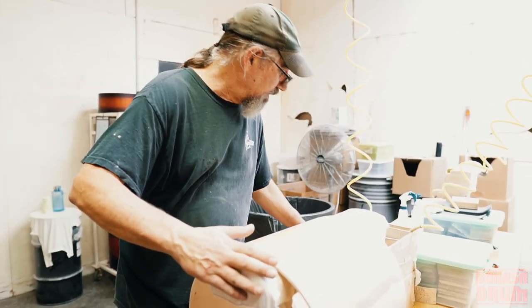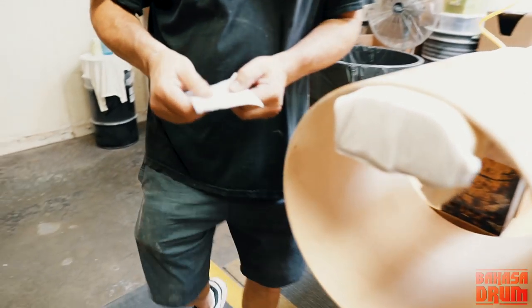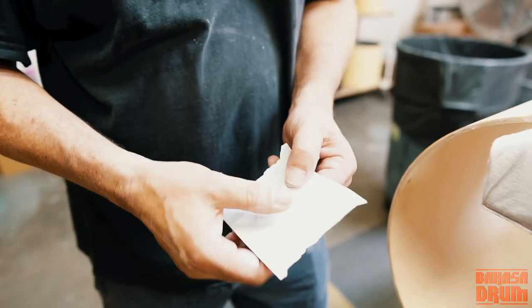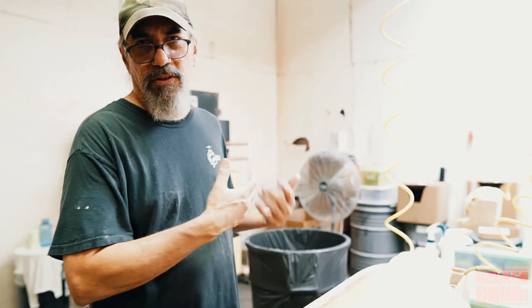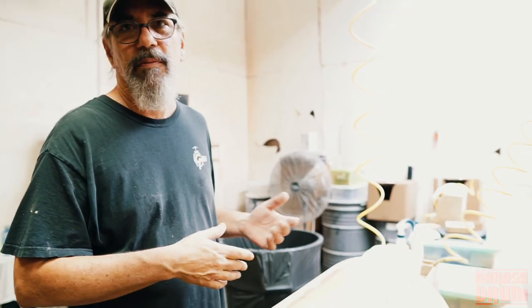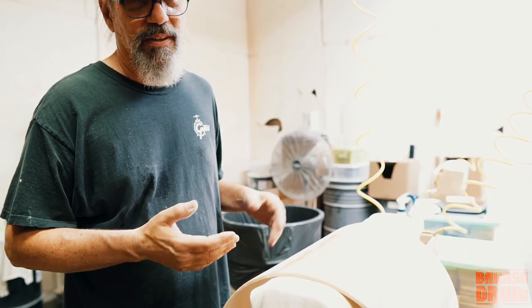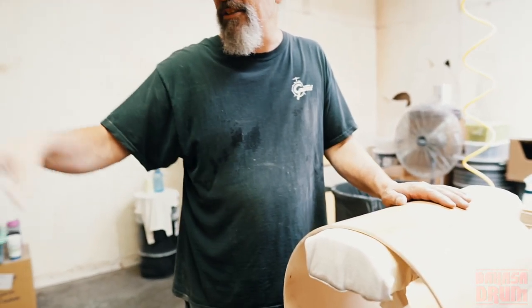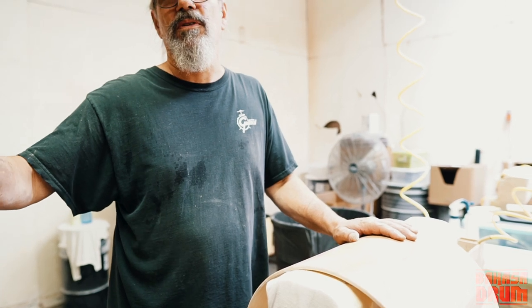And the minute the sandpaper starts looking like this, right? You gotta start a new sheet. Get a buildup of material on the paper, it's time to switch the paper. So in the course of a day, we go through a ton of sandpaper here. And typically a rack like this might take an hour and a half to do, depending upon who's doing it. And so normally in the course of a day, we'll scuff sand 20 or 25 racks.